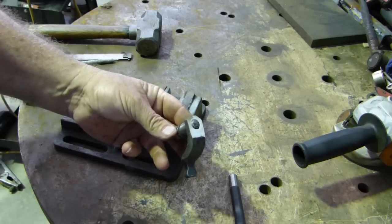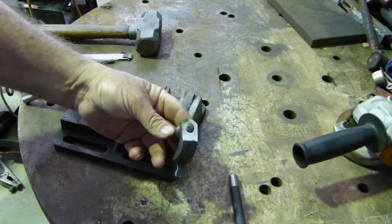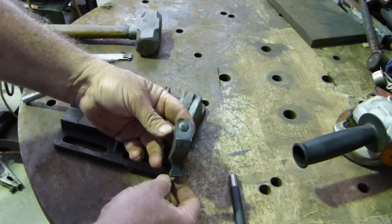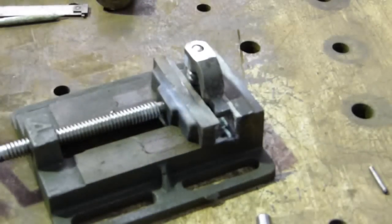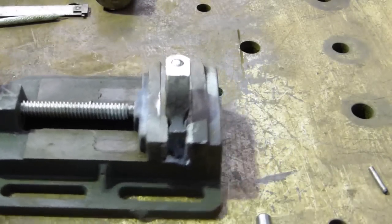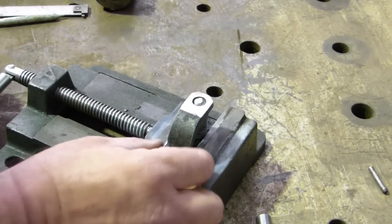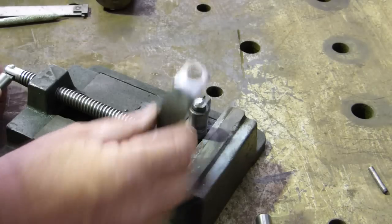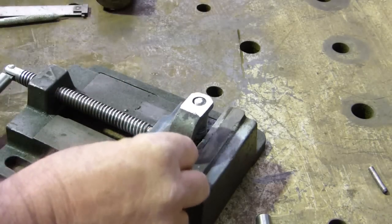I think I'll tidy this up, level it off a bit, get it down in there a bit so there's quite a body of weld when we hop into it and blow a few arcs around in there. What we've done there - we've put a bit of a chamfer on here, just so down inside here we can get a little bit more weld.